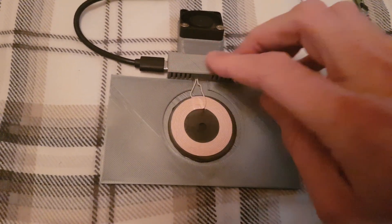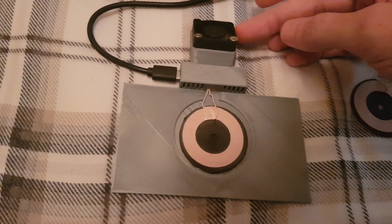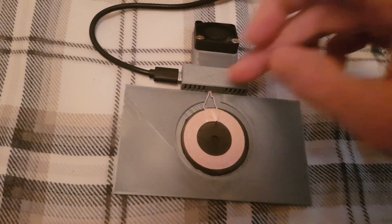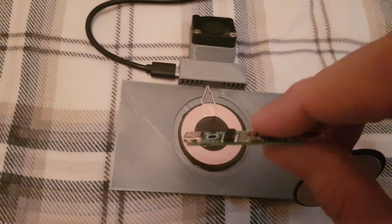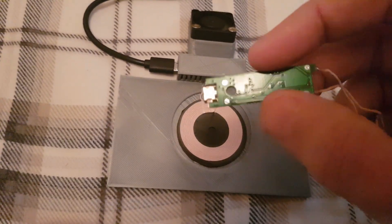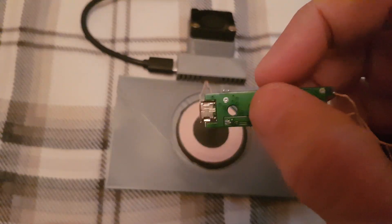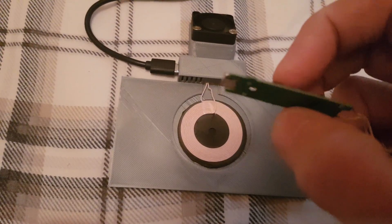That's the reason why I've designed this. Basically, air is blown through here from the fan, coming through and then out these cooling vents at the front. So the air is passing over not only the top of the chips on the board, but also over the heat sinks stuck to the back. You want to make sure the grill lines on the heat sinks are going with the airflow — going in this direction — because if they're the other way, air won't pass through the heat sinks properly.